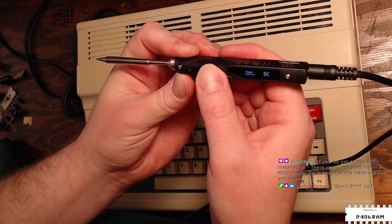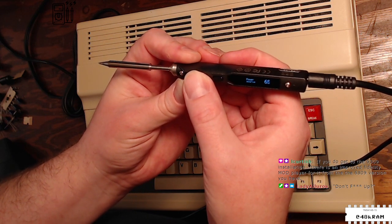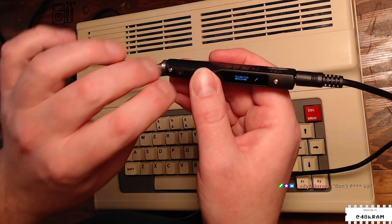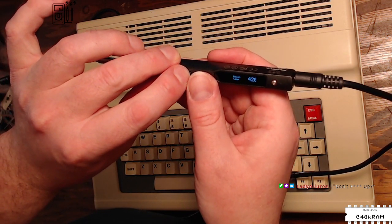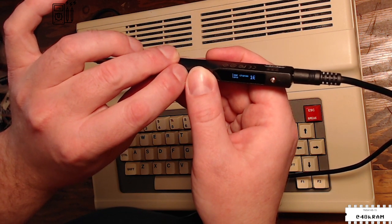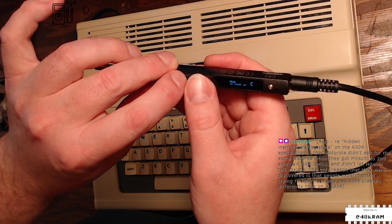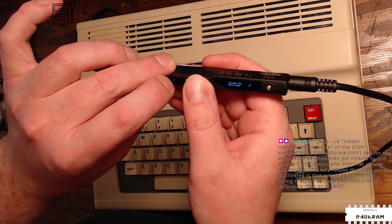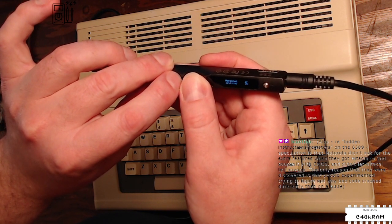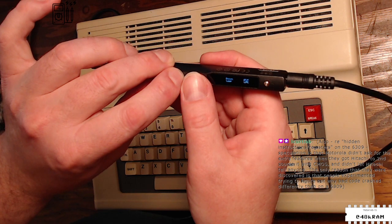Yeah, all right, power settings, power source DC. No, wait. Nope, come on. Power source DC. The menu is a little funky with just two buttons. Soldering settings, boost temp set to 420. Nope. Heat on power up. Nope. 5 degrees at a time. Soldering sleep mode. I don't think it wiped out my settings. I think we're good. Do need to get back to soldering settings, because I want to set that back to 420.